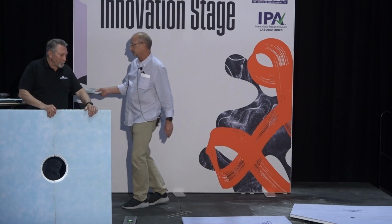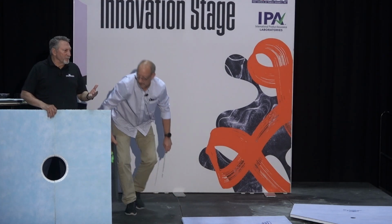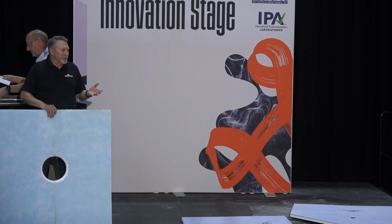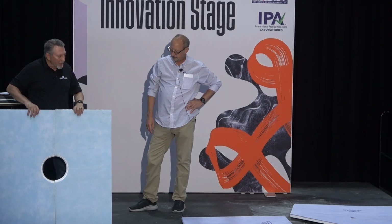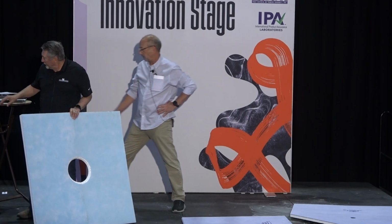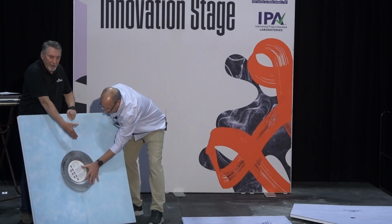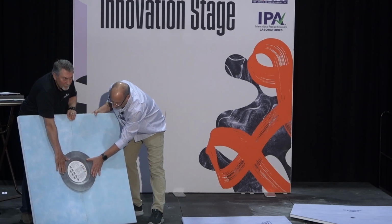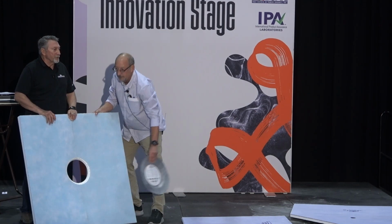In the commercial field, 90% of the time it's going to be a cast iron 3-piece clamping ring drain, because a lot of times PVC is not allowed. So you're going to have to deal with that and use a NobleFlex drain flashing. But the base, we have now made the commercial version. We've put the divot into this, and that'll go right into there, tie into your drain, and then your membrane will go on the base, lap over that flashing, and make a waterproof downhill shingle seal.